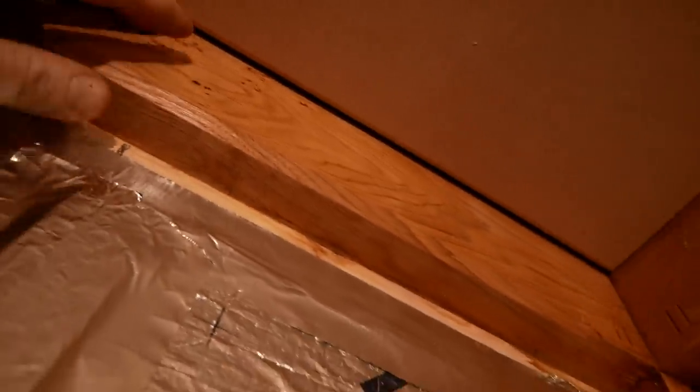It's a bit dull in here now I've blocked off the light. Let me show you what I'm on about with this shadow gap nonsense. So I've put a chamfer on the edge of this MDF, and there's also about 2 or 3 mil of foam, although some of that is shadow. So that is what I'm expecting it to look like after, I don't know, a year or two. So to start with, I'm going to almost take it tight, maybe a millimeter gap.